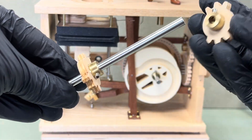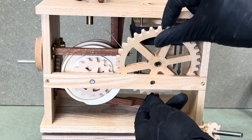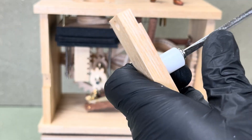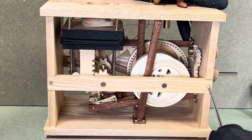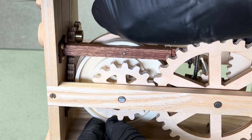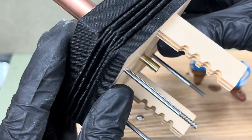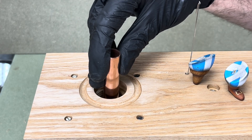For the second shaft I first insert a liner and fix the two intermittent gears that engage with the bellows rack, then slide in the shaft along with the larger gear and nylon washer. I follow that by adding the second support, which holds the opposite end of the shafts and includes a nylon roller that prevents the bellows rack from disengaging from its meshing gear. With everything in place I secured the gears and cams, carefully aligning them in their correct timing position, using the orientation of the grub screws as a guide — all aligned in the same direction. Tightening them is fiddly as some are tucked away. Now I'm fitting the copper tube that directs air from the bellows into the cannon; it also supports an internal brass collar soldered together for strength.